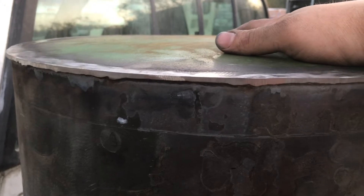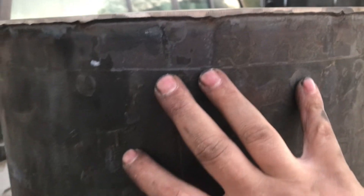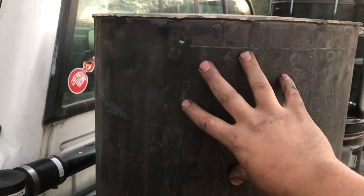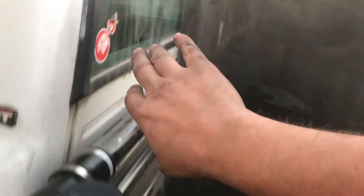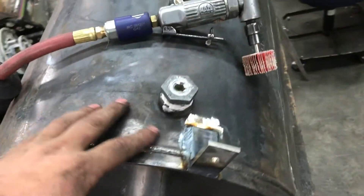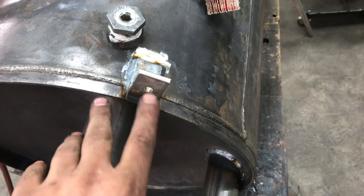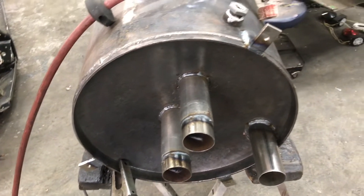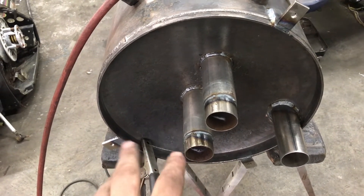That's why I went with the heavy stuff on this. This container is also 14-gauge — it's got that protective coating on the inside that'll keep the wood gas from corroding it away. Once I have the fill lid on it, I'll reach down inside and paint the inside of my welds on all three of those pipes and paint the inside of where these go on, so I've got that one extra layer of protection. There I got the feet welded on — just a piece of quarter-inch-thick angle iron, one-and-a-half by one-and-a-half. Cut it an inch wide with a three-eighths bolt hole. They're triangulated on there, and I made sure those bolts are going to land in the middle of a two-by-six on the bed so they'll have a good purchase.